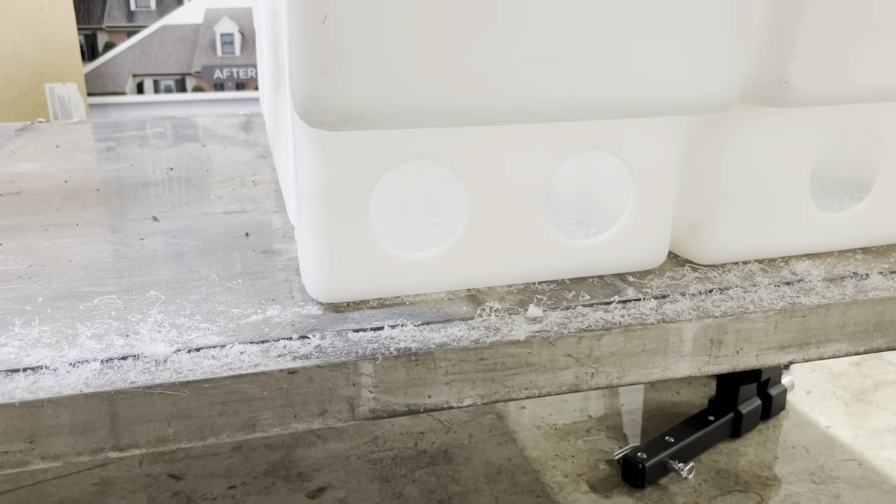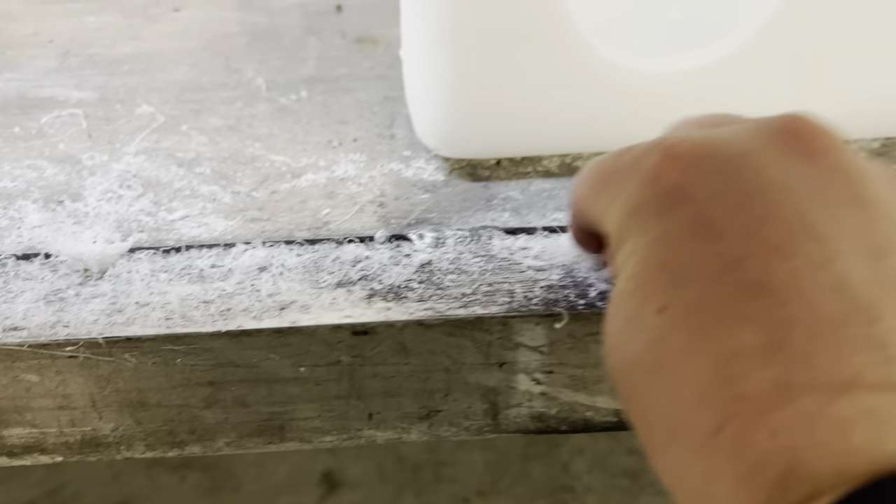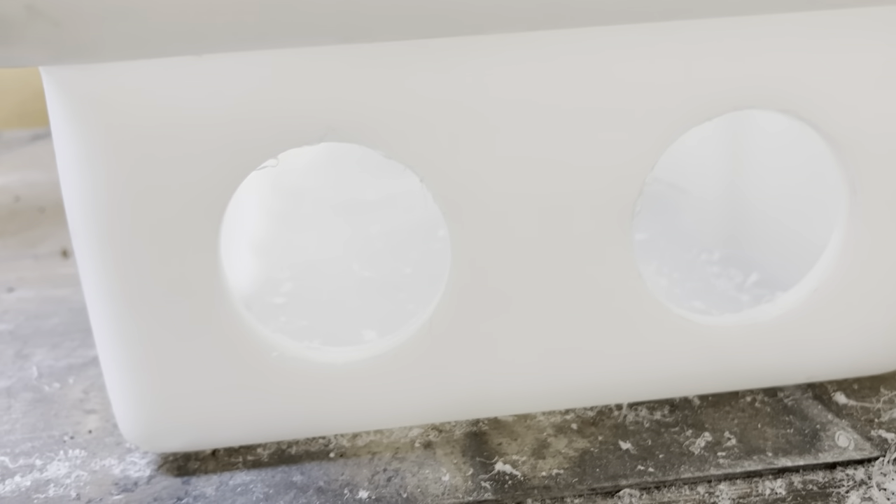Real quick, I just wanted to mention before we get these things tied together — you're not really going to get a better view of it until now. Look at all this — it's all plastic pieces. Look inside the tank there. Obviously, if you don't have filters in your tank, you're going to have issues. But beyond that, when you do a build for the first time, pull off all this stuff and vacuum out your tanks and make sure they are thoroughly vacuumed out. There's a ton of debris on the bottom. You get one of those inside one of the check valves or in your plumbing — game over. You're going to be down a day or two trying to figure out what happened. So work clean, get the stuff cleaned up, don't let it sit in your tank.